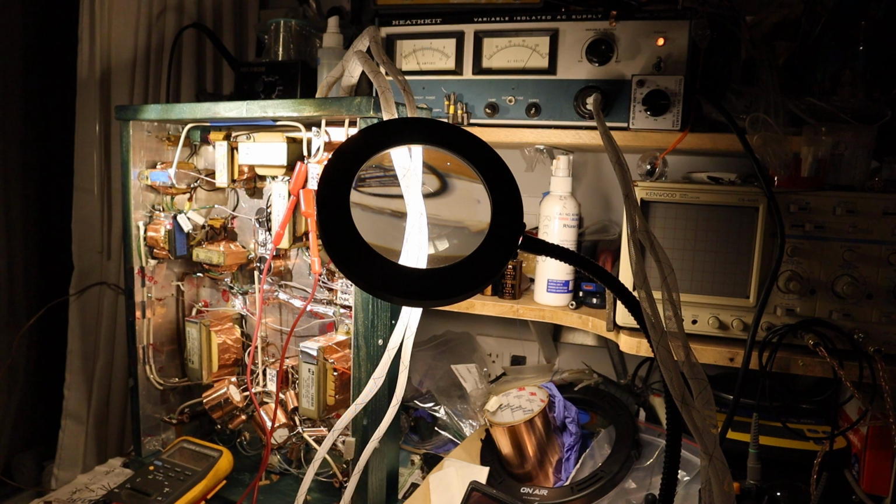Don't worry. If you are a first timer, you turn on your tube amp, and even though you are feeding them such massively higher filament voltage to an input tube, they are in no immediate danger unless they are modern production tubes. If they are modern production tubes, there is a good chance that with the turn on, they will just blow up, the filament opens up. But if it's a new old stock tube, they can easily take it. They won't even blink if you subject them to let's say even 30% filament over voltage for just a few minutes, or even an hour or two or 10.